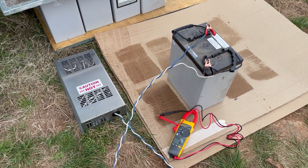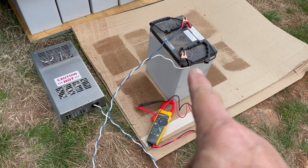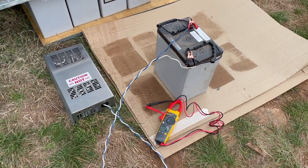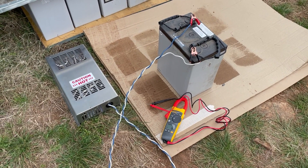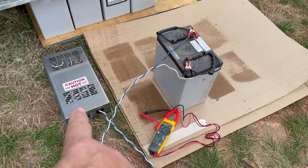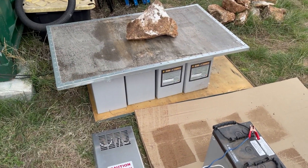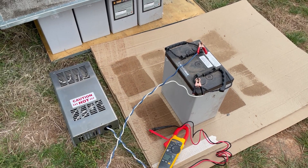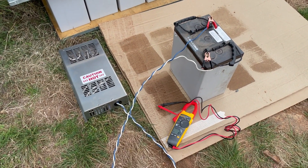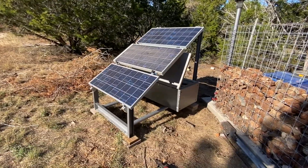The load test procedure is: put a quarter-ohm load on the battery for some number of minutes, then measure the voltage after the load to make sure the battery has enough capacity to be included in a group. These batteries are passing — it's cold so the dummy load doesn't get too hot. Some batteries over here have bad terminals. This is the last one I'm testing — going into its sixth use on the homestead. They're like commodities — move them around until they just can't anymore.